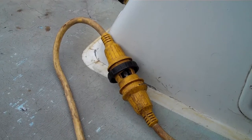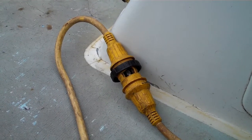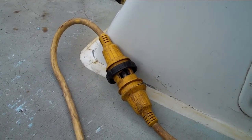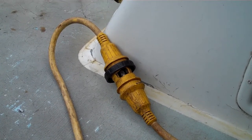If the hot water heater kicks on it takes another 10 amps, so it's going to run over 30 amps. The cords are made for 30, but they'll actually pull about 40 amps — you're not supposed to, but they will pull probably around 40 amps.